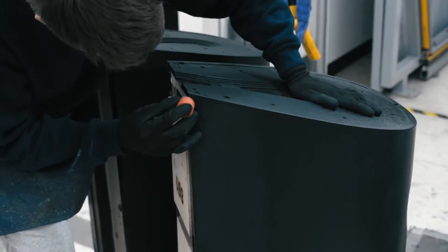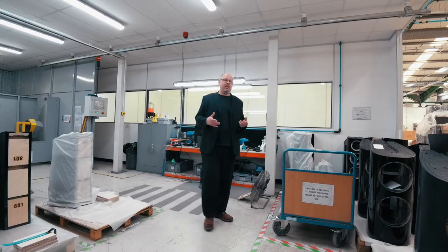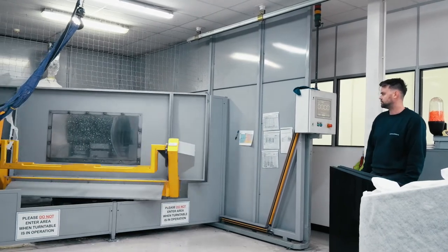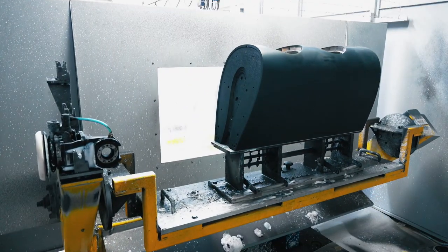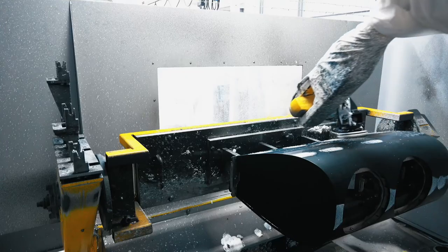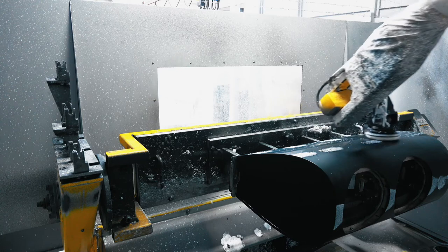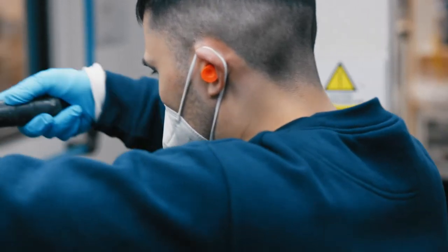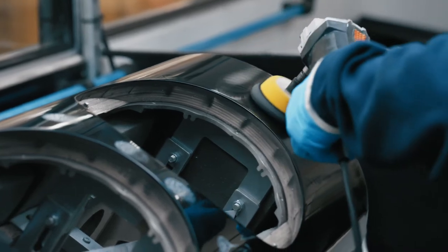This is our polishing area. What we do here is take the finished and prepared cabinets and produce that high-gloss sheen necessary for a piano gloss black finish. That takes two processes: first we put them into the robot polisher, which operates very similarly to the robot sander you saw before — the difference being it uses a polishing compound head instead. It takes around 70 minutes for a cycle time, after which the operators take the product out and finish it by hand, very similar to what you saw in the sanding area.